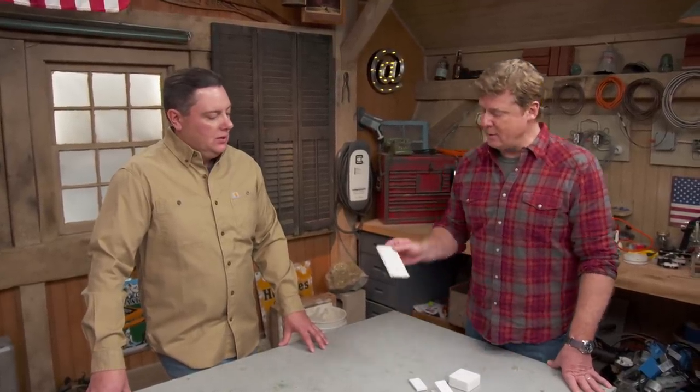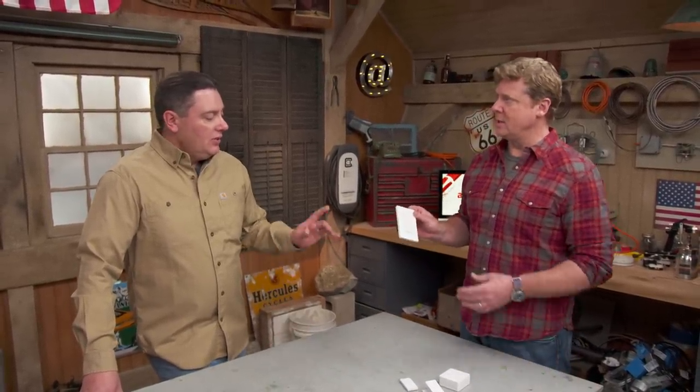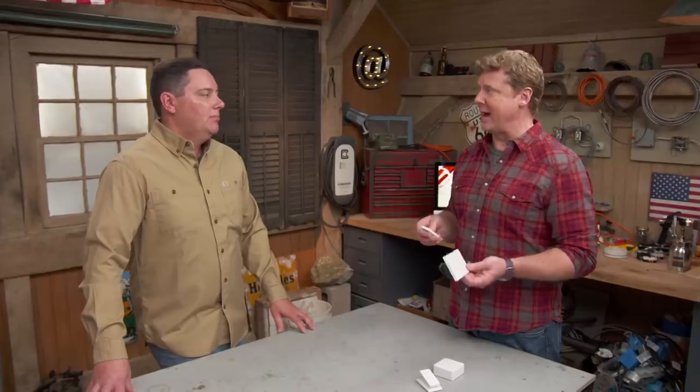Nice fix. I like the solution, although the problem seems pretty quirky — four switches, three locations, six lights, that's not typical. Other places you might use a solution like this: picture a large room with a single switch on one side; walking out the other side you'd never have a switch to turn things off. You'd want a three-way but don't have it — this gets you there, easy to install.